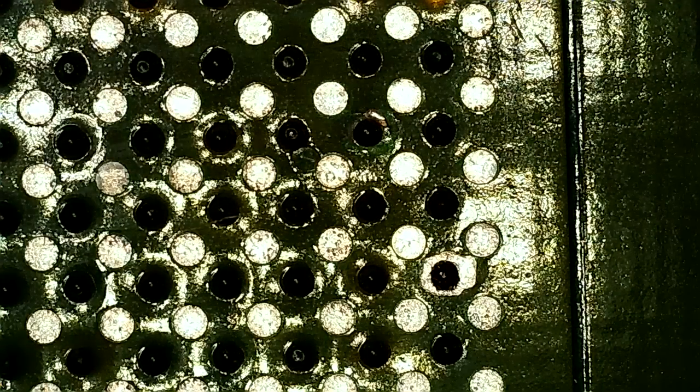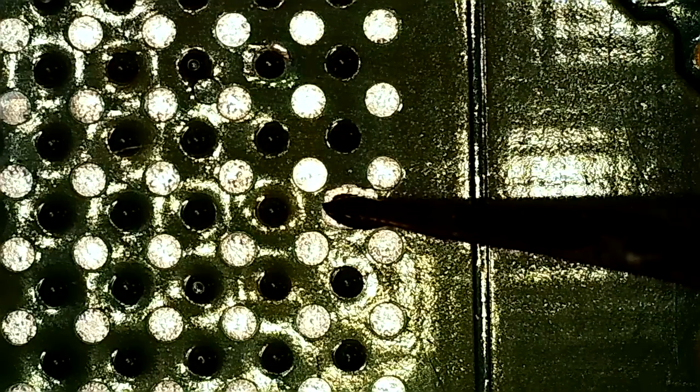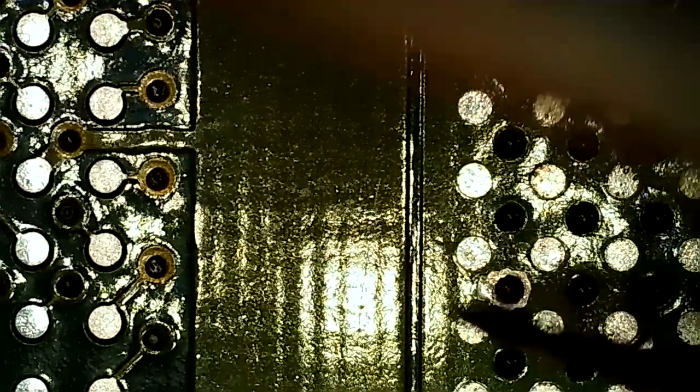The thing is, I'm not worried about a short there or something like that really, because as you can see they're connected. But I was more worried that the balls might go where they shouldn't. So we could put some solder mask on there because there's nothing that's supposed to touch the via. So we could use a really thin layer of conformal coating. We could dilute it with IPA, the alcohol I'm using. So, I really don't want it on the pads, no. To be a bit careful.